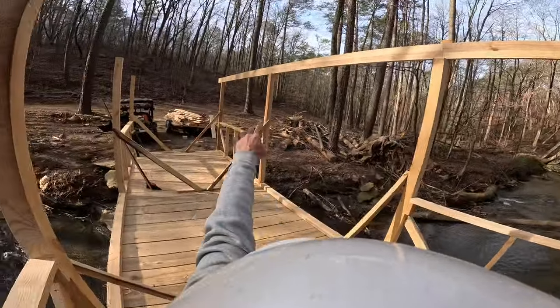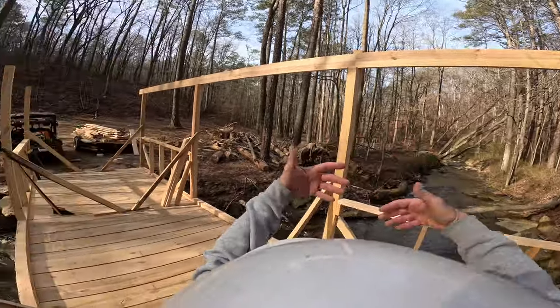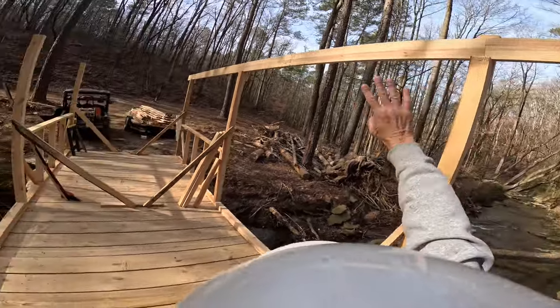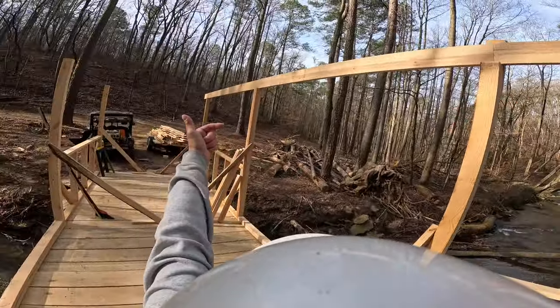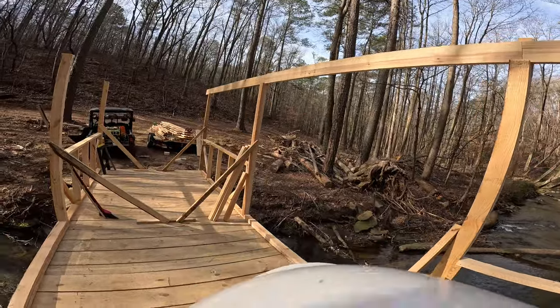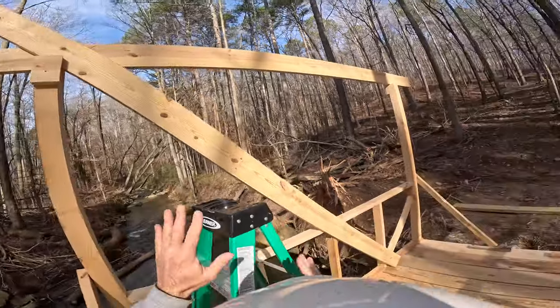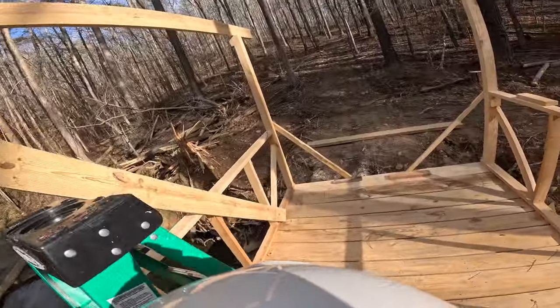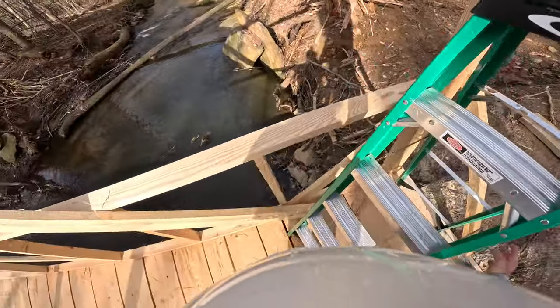All right, now we're gonna do the second layer beam. We're gonna overlap these joints because the main weight bearing's on the front, the outside edge. And so I'm gonna run these two boards long and then I'll fill in the middle to span that. We've got my second one up there. It was starting to fall down, so I nailed a little block up just to keep it from sliding off